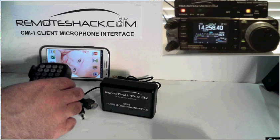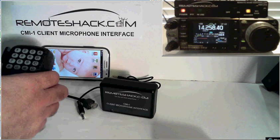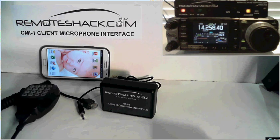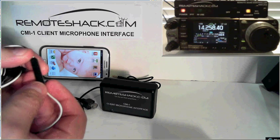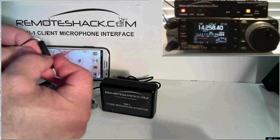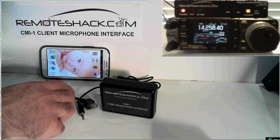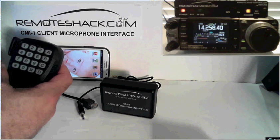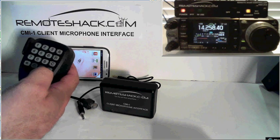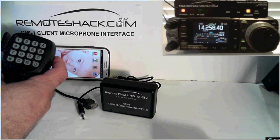In addition we have four additional buttons A, B, C, and D that allow you to control the phone's functions. They're the same functions found on a headset — the plus and minus buttons and the hang-up — and they're there on the DTMF microphone so that you can take a call if need be. If you're on the remote, just hit A and it'll take the call. Hit B and C for volume up and down, and D is for muting the microphone.